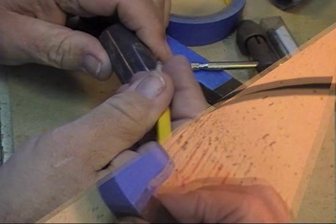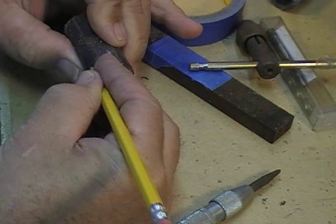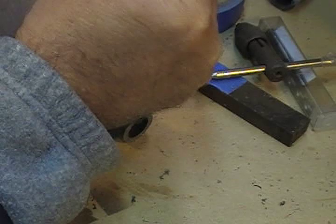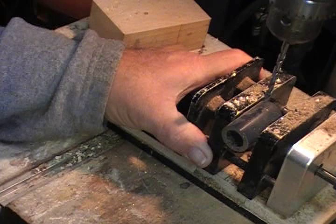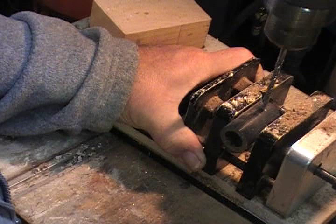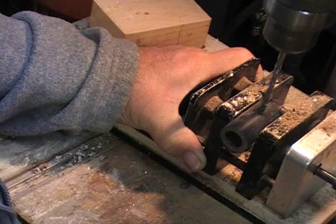I'm going to lay it out about 3/8 of an inch from each end and mark it, then snap a point with my spring-loaded center punch. Now I have one marked 3/8 on the front, one on the back. I loaded it into my pen vise because that holds rounds pretty good. With the proper size drill bit from a quarter-twenty tap, I go ahead and drill this. You don't want to go too fast because you don't want to oversize it — remember, it's plastic, it will heat up and swell out. You're going to need all the threads you can get when you do it in plastic.